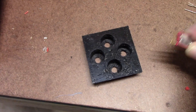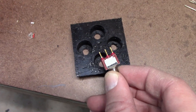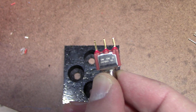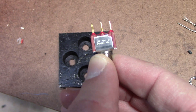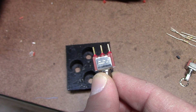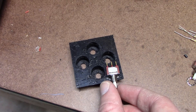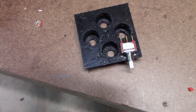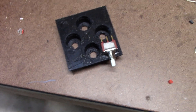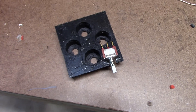When I add the switches, you can see there are three pins on the bottom. Those pins are: common, which is all the way on the right; normally open, which is in the middle; and normally closed, which is on the left. When the button is not pressed, there's connectivity between normally closed and common. When the button is depressed, there's connectivity between normally open and common.